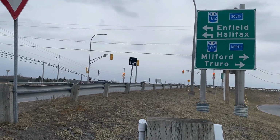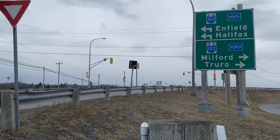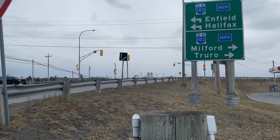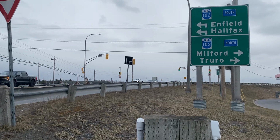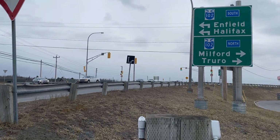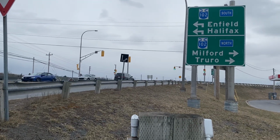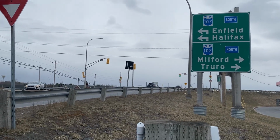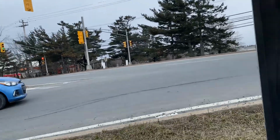Elmsdale new sequence. So they run a bit more efficiently now. So that intersection over there will only turn red if there's a call on phase 8. Both of those directions are running 2 adaptable overlaps for phase 6. All of the main street sensors over there and here will call phase 6.